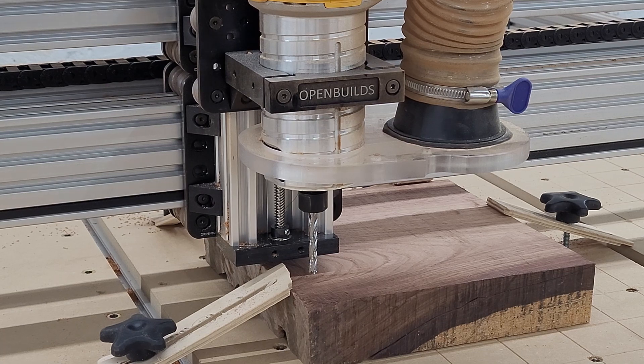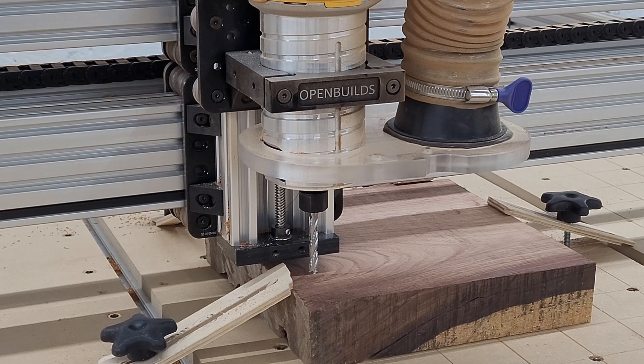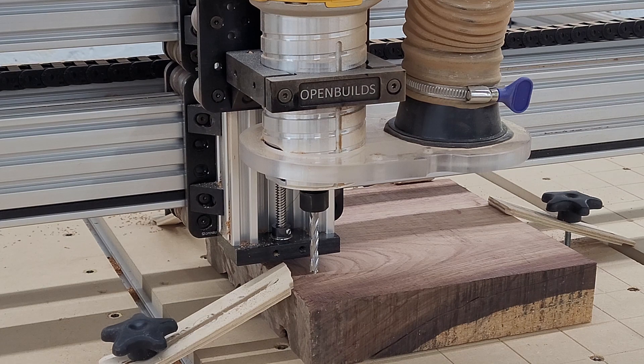We're going to try this on the rosewood using the same tool path as on the mahogany. I'm going to let it run at 80 inches per minute feed, but I've backed the plunge down to 40 to start — I couldn't even begin to run at 80 with the other bits. We're doing this in three passes instead of five, so it's roughly 0.15 depth at a time.